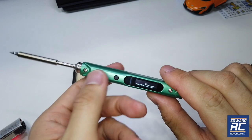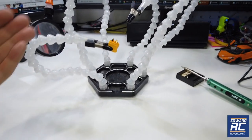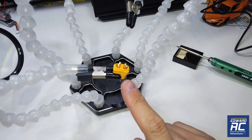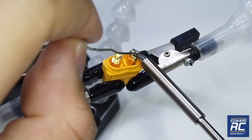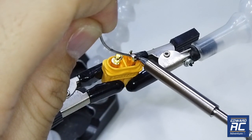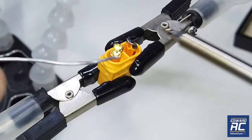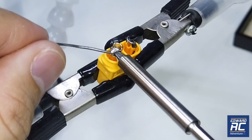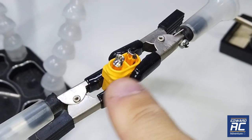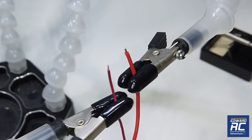After reboot showing the version, press button A and it goes to the preset temperature of 300°C. I have a very cool octopus assistant with six claws — I'll share the link in the description. We're going to test this by soldering an XT60 battery connector at 300°C. The solder melts really easily — very easy. The tip is hot enough and the solder melts and flows onto the component very nicely.